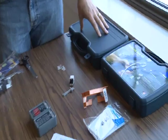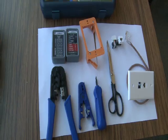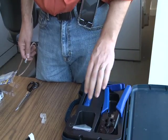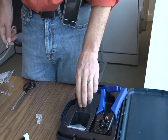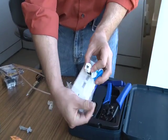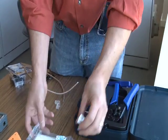These are the basic tools you need. It's a simple network tool kit. It comes with a crimp tool, which will help you terminate the RJ45 connectors. There are also various cutting tools that come in this kit, which will help you trim the Cat5E and Cat6 cable. And a punch-down tool, which will help you terminate panel-mounted connections. These are connections that might fit in a wall-mount unit, and might interface inside a client's home the same way an electrical outlet will, except it's Cat5E cabling. The whole outlet has to be rated for Cat5E to be contiguous and Cat5 throughout the whole system.